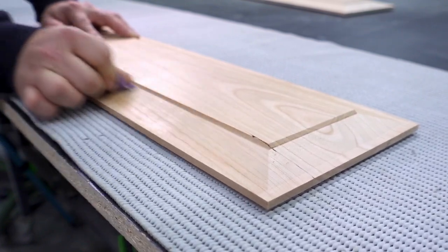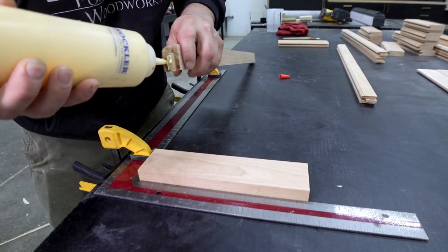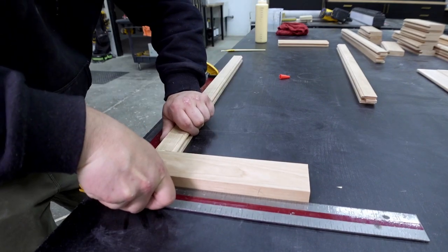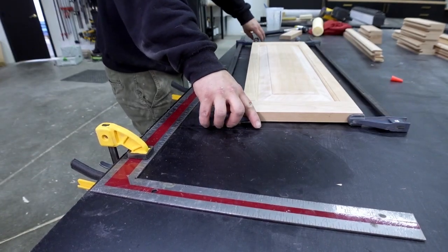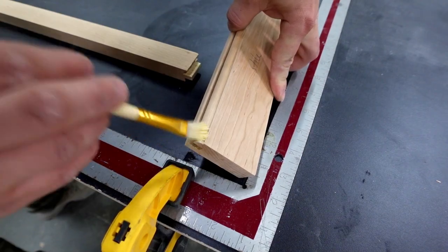Whenever I'm gluing a stain grade or clear coat project, I'm making sure I keep track of all traces of the glue. If I use too much and get a ton of squeeze out to clean up, chances are I will leave glue staining behind, and when finish is applied, this exposes the ugly staining. So I use just enough glue and clean up well with a damp rag.